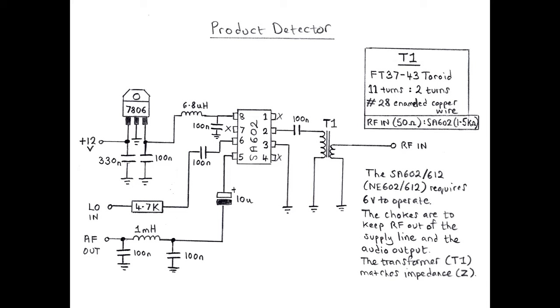The only thing to mention here, which is a really important thing to grasp, actually, is impedance matching. When you're dealing just with audio work, this is not really such a big deal. The rule of thumb is that as long as the stage you're feeding into has a hopefully much higher input impedance than the output impedance you're feeding from, you're okay. You want to go from low to high. But with RF, it does matter, because maximum power transfer happens when the impedances are matched.